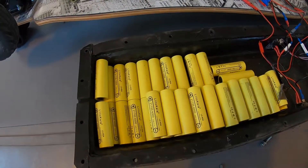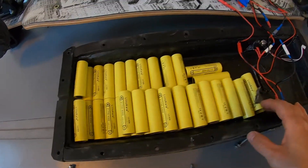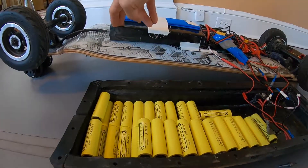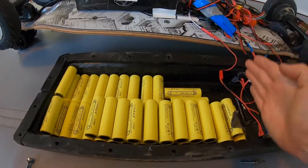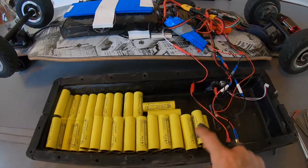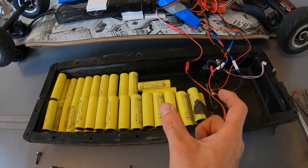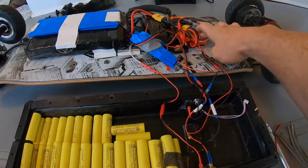I was super sweating here. I didn't think that a 12s 5p battery of these cells would fit in here. I thought it would be a really tight fit, but it's actually looking really good. If you look at it in comparison with my battery that's right here, it comes all the way over here and this area is lining up with the BMS. For this build since I'm building a bigger pack, I'm going to be using a charge-only BMS from the Bestech D140, which would be a little bit smaller with a nice small footprint.